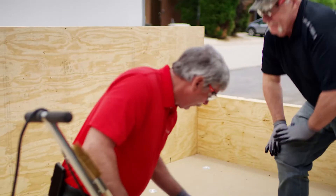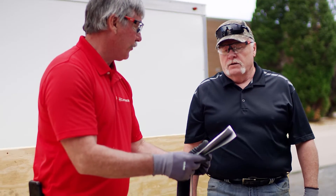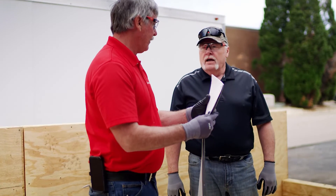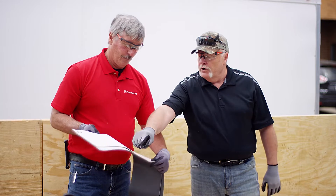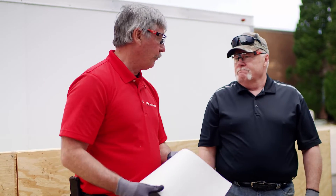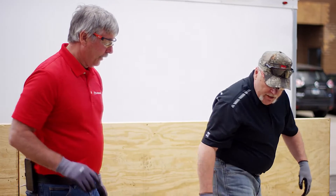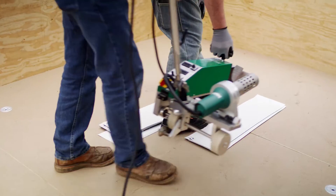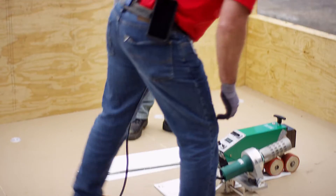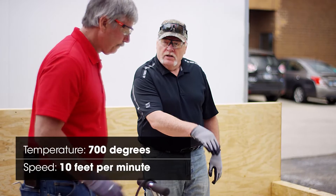How much do we want to lap these? Just about an inch or so from the edge, because you're going to do a field pull. What's the correct way to test this? You want to go cross-machine — so if this is machine direction, you cut across the seam. One inch across the seam is the proper way to do it, just like ASTM standards specify. Make sure your temperature is set, your speed is set, and your air dam belts are engaged before you run.